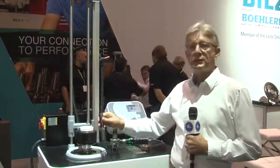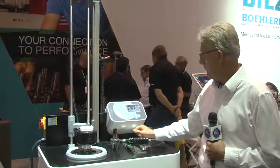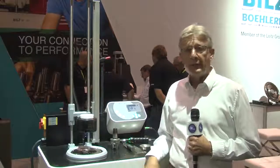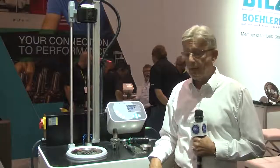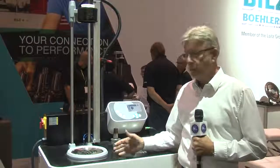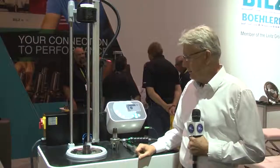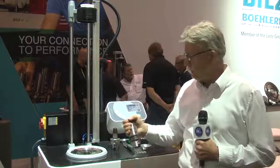What we can do at this point is interchange new cutters for old ones — old one out, new one in. The dwell is fully programmable from three seconds up to 30 seconds. The tool has gone into the machine now. We are liquid cooling, so there's an anti-corrosion element and an antibacterial growth element in there. Perfectly safe. Fastest cycle time in the shrink world. You can see the tool is being dried off and now it's cold and ready for use. Very safe and extremely manageable.